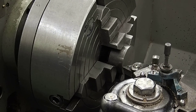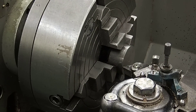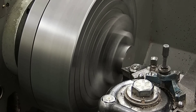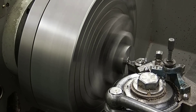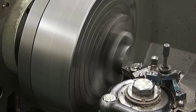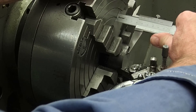We'll bring the carriage up again and we're ready to face the second side. Lock the carriage because we don't want it moving. I need to make a decision as to how big the square is going to be - if it's going to be one inch, I'll take a little cut and measure with the vernier. Touch the part, clear the part, set depth of cut, and feed in towards center. Now that we have two faces that should be parallel to each other, I'll measure and it's one inch - I'm happy with that.